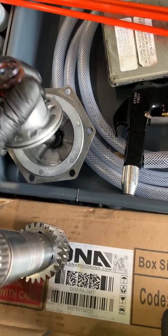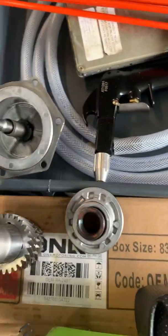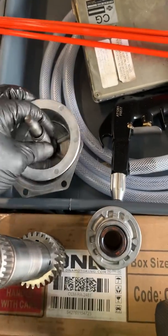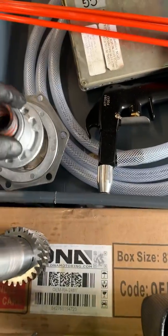I ended up disassembling this. Took a look at the springs — the springs are okay, the seals are okay, though they're still all getting replaced anyway. Took a look at the main piston, measured everything, and it still seems to be good. So ended up moving forward.